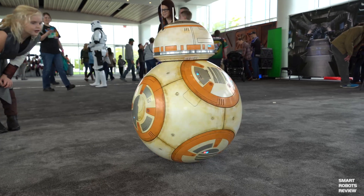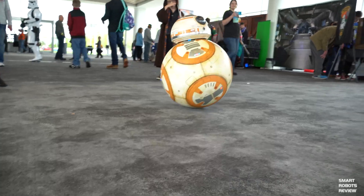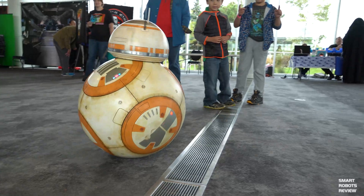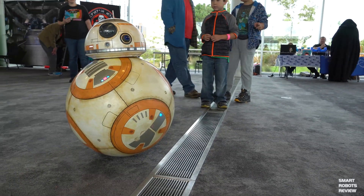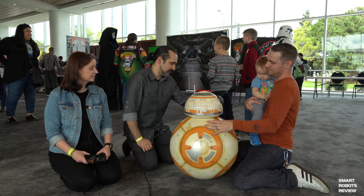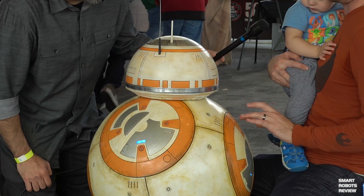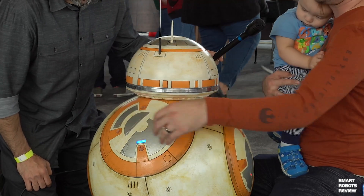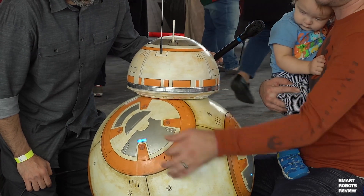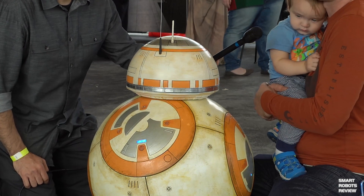Now he's incredible, I love the LEDs — very realistic. How do you service them if you need to get inside the big sphere? I normally take off two triangle panels and then unscrew the panels for one of the circles — usually the easiest one because it only has one section of lights. I have servo connectors on either end so I just unplug it. If I take two triangles off I can lift this one out of the grooves of the other two triangles, so three panels have to come off in order for me to get in there.